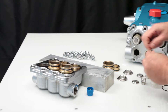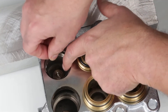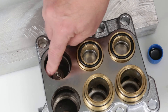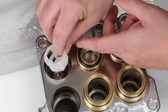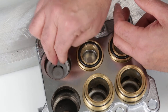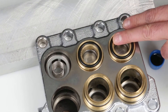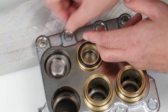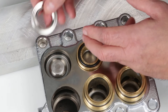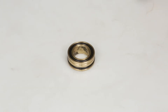To install or replace the valve assembly, begin by lubricating the inlet valve seat and install on the step of the valve chamber. Next, install the spring retainer with notch facing down into the valve chamber. Place the spring down into the inlet spring retainer, followed by the valve with concave side facing down. Last, place the valve seat with the tapered surface facing down. Before reinstalling the low-pressure seal adapters, replace the O-rings provided in the valve kit.